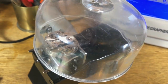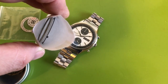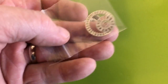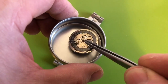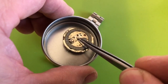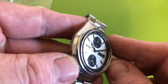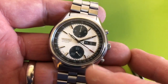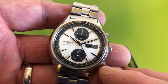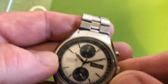That is it - more or less work than I expected. There are your spare parts in here: these are the day and date wheels, the silver ones that were wrong. Here is the movement - it's unfortunate that the chronograph wheel tip is broken off; I can sometimes reuse those but probably not this time. Anyway, there it is: new crystal, case is entirely clean, all new seals, a beautiful nice new crystal. It's everything you want in a panda - I retouched this to give it that tomato red. There it is in all its glory, much happier than it was before.